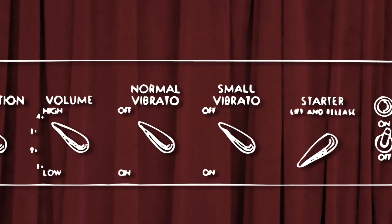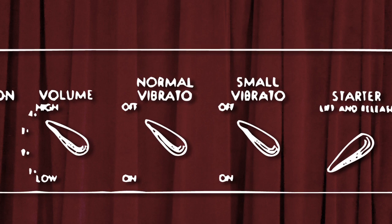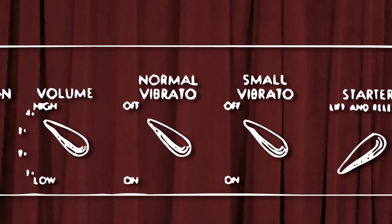Lastly, the Nova Chord actually had a low frequency oscillator — we'll just call it vibrato because that's what it was. It wasn't just a simple LFO; what it really was was a mechanical vibrato circuit that employed mechanical technology to create a really diverse vibrato that was more natural, more music-like — not just a variation in pitch which would sound spiritless and boring. There were two different vibrato circuits that could be used to create a really natural vibrato sound.